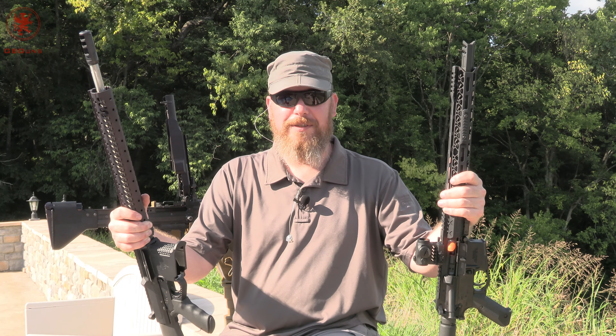Just in case some of you were curious about seeing what a gun looks like after so many rounds and years of no cleaning and just being lubed, we're going to split this thing open. The carrier is textured — not with any coating other than carbon. This has been running a lot suppressed, and the gas rings are getting a little tired, but they're still running.